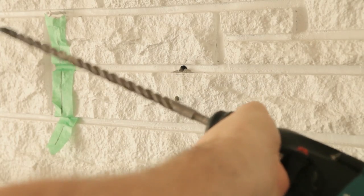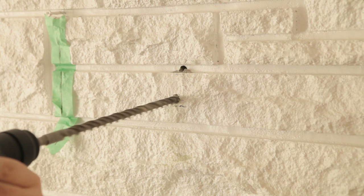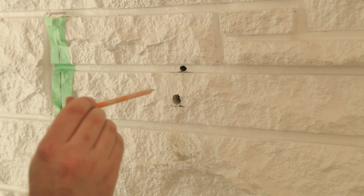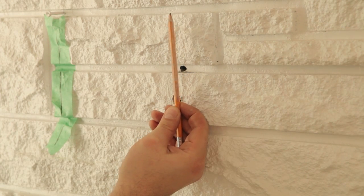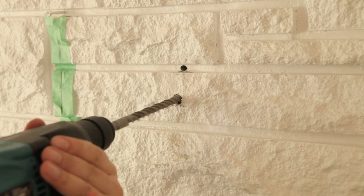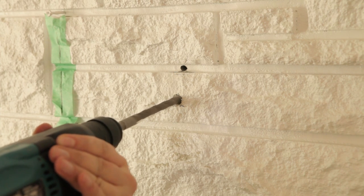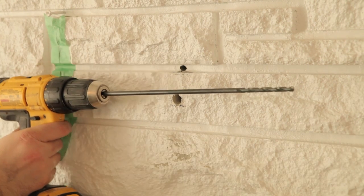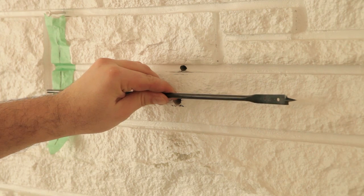Here's the result of all the holes done with the quarter inch drill bit. I decided to test one of the holes with the larger drill bit to see if that would make it easier to install. Starting with the smaller drill bit and then moving up to the larger one meant the second hole went a lot faster. After a bit of drilling I could tell that the drill bit had hit wood and wasn't going forward any further. I used a pencil just to clean out the hole and measure how far down I was — I came in at around four inches. My plan is to use a type of anchor that will slip through the hole through the plywood and then expand on the other side once I pull it tight, so I need to drill a hole through the plywood. The anchors I've chosen require a 3/8 inch hole to be installed correctly. I'm gonna start with an extra long quarter inch drill bit just to tap the hole, then use a 3/8 inch spade bit to get it done.